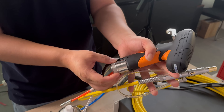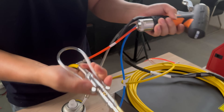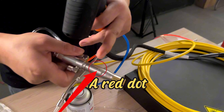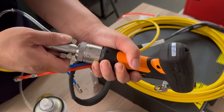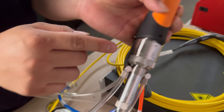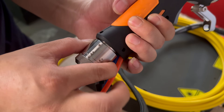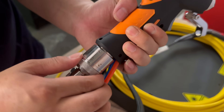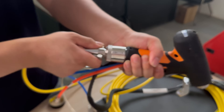We loosen it. There is a red dot on our QBH — the dot should align with our gun head. Align this dot with that dot, leaving the middle hollow. Don't attach it to one side. Then loosen the lock we mentioned earlier, turn the arrow over, and tighten it. The fiber cannot be pulled out.